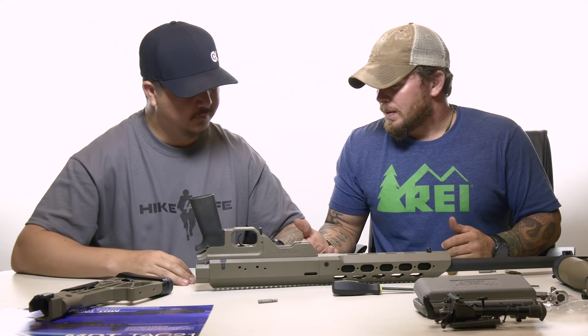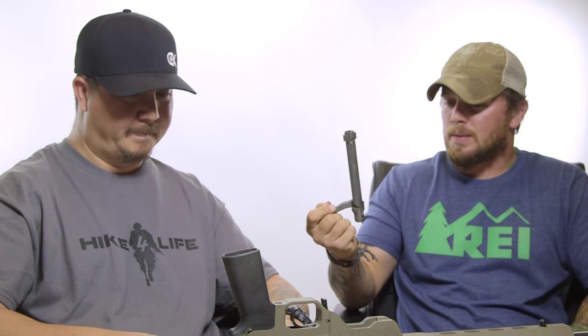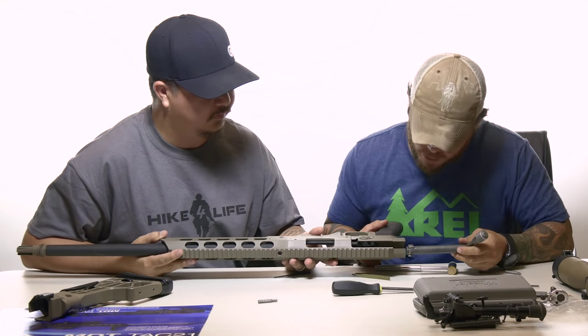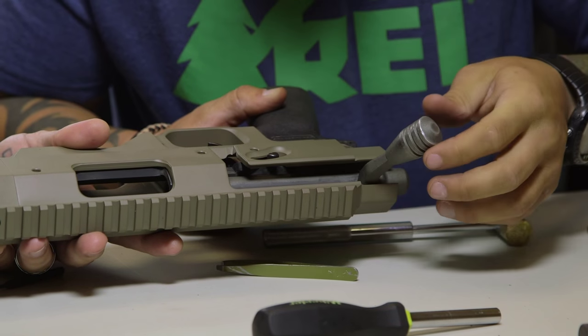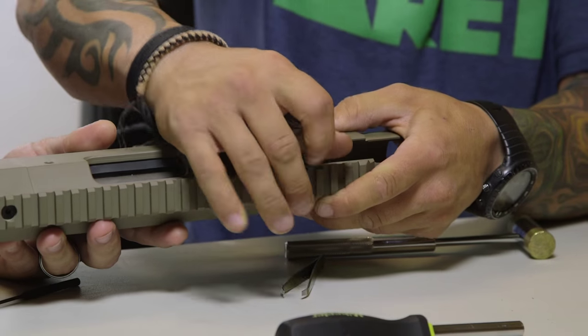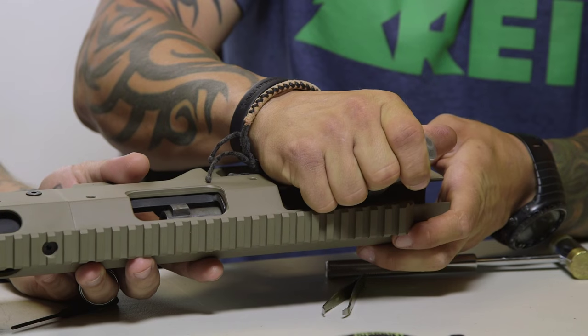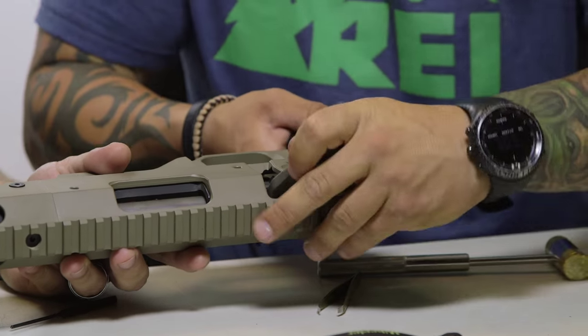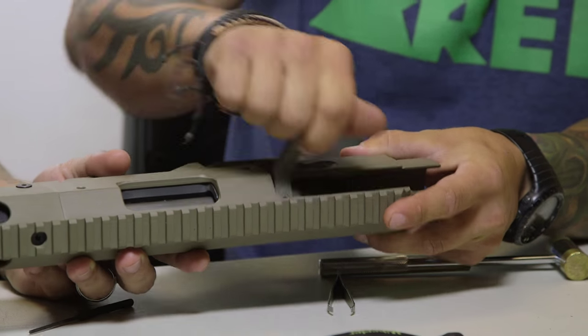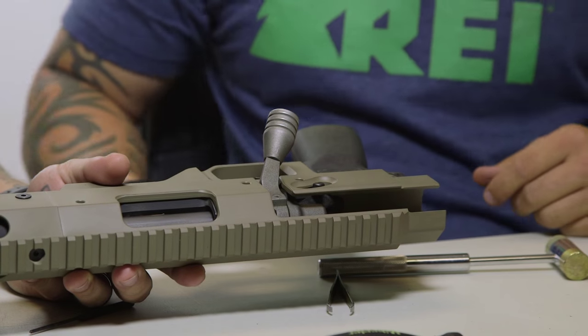We're pretty much ready for the installation of the buttstock, but there's one thing left — we need to put the bolt inside the receiver first. It's important to put the bolt in before the stock because once you have the stock on, the bolt won't come out. The stock does prevent the bolt from coming out — that's actually one of the features. So we'll slide the bolt in, heard the positive click — positive retention on the bolt. We'll verify the firearm is clear, then check function. Positive functionality. Safety works — successful trigger installation.